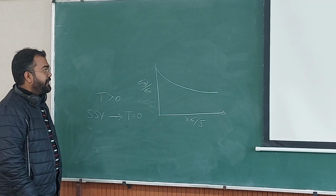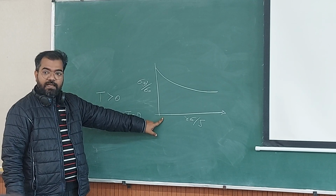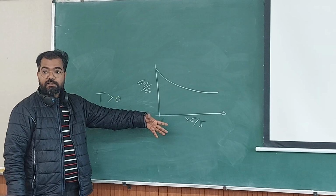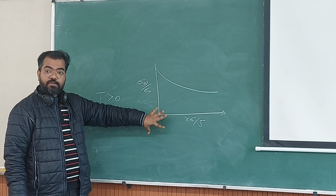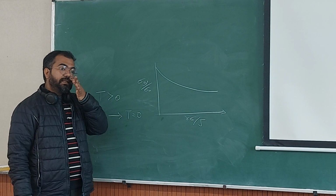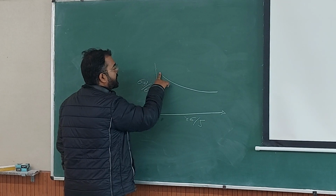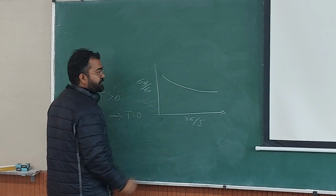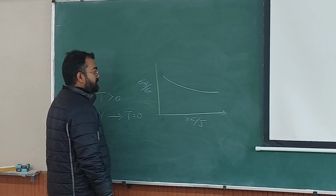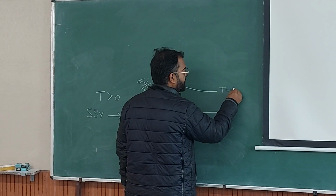and you will really not have values here when r is 0, because finite element analysis cannot take care of, even if it can take care of finite strains, even then there are a lot of things going on at the tip. You have damage and all those things, and if you incorporate damage, you are still not sure what is happening at the tip, so you discard the values here and you can only have the idea there. So this will look like this, and this is for T stress equal to 0.